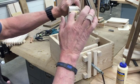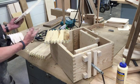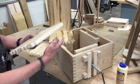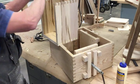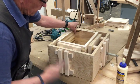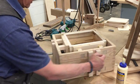If you get a little bit of drippage, that's life. Set your piece down and get the glue off your fingers so you're not getting it all over your project. Then slip one end on, then slip the other end on, and put the top on. Put it in the jig, then tighten one side a little bit snug, bring the other side up and tighten it snug, and work your way back and forth.